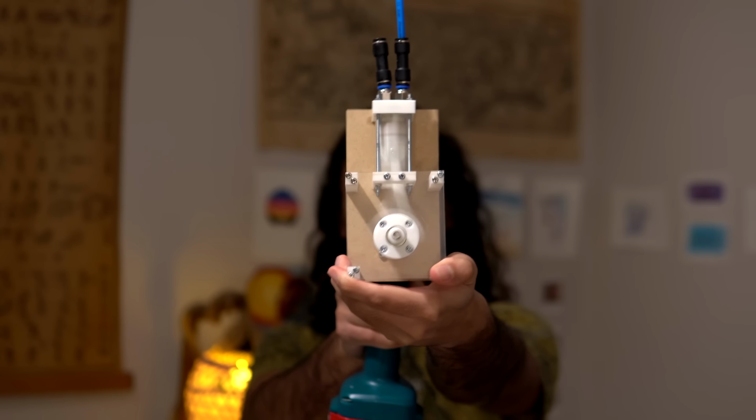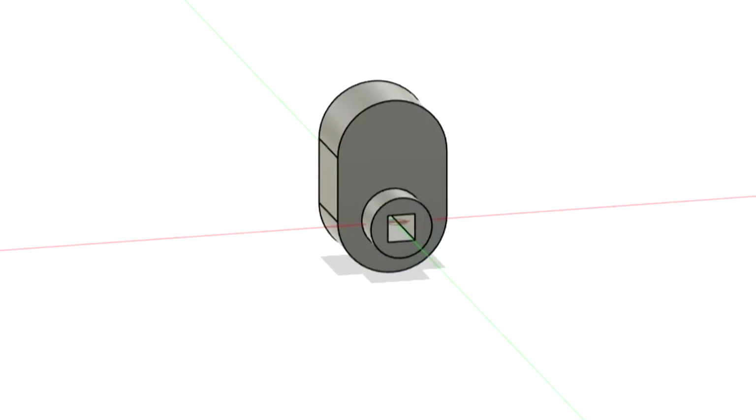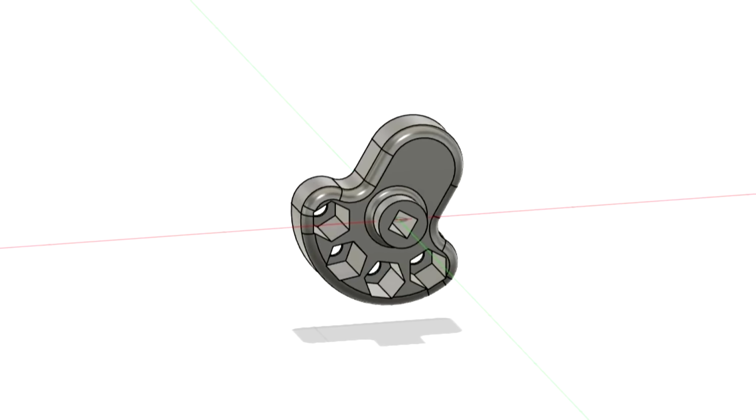To overcome the vibrations caused by the inertia, I changed the cranks. I added some slots to put some nuts in as counterweights. This counterweight is moving in the opposite direction of the piston. Therefore, hopefully it will cancel out some of the vibration.